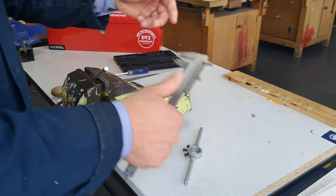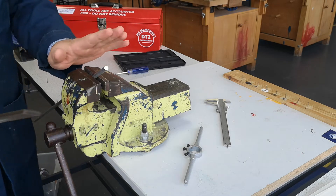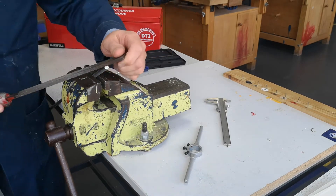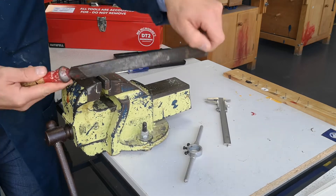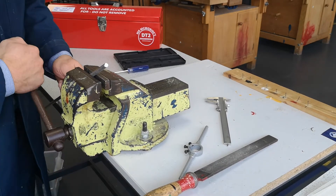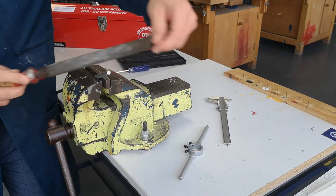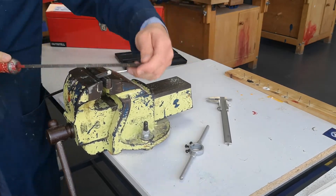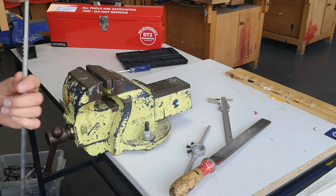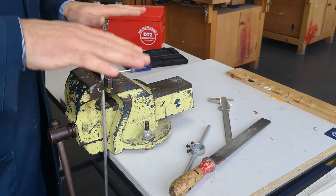After gauging the correct bar size, put the bar into the engineering vice and get a flat file. Rotate the file around the tip of the bar — you should be able to get at least 180 degrees around — then spin the bar half a turn to continue the chamfer around the rest of the tip. We're doing this to make it easier for the die to start, centralise, and remain completely horizontal.